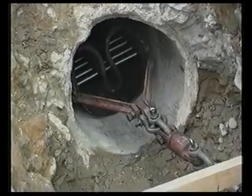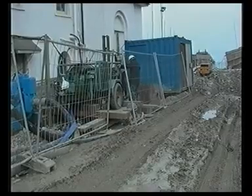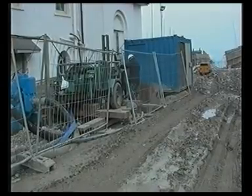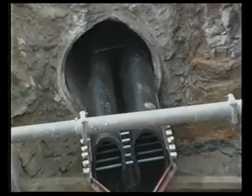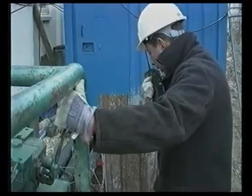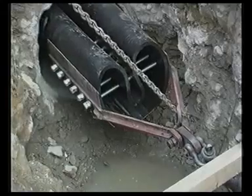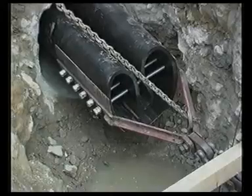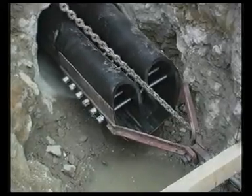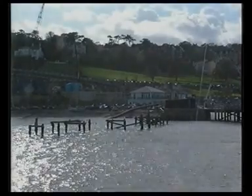The winch at the other end of the section to be renovated pulled through the 300 metres of pipe at a maximum pull weight of 8 tons — one fifth of the maximum permitted for this size and SDR of polyethylene pipe. The liner pipe was in place on schedule, a performance critical to the other extensive renovation and improvement activities being carried out by Wessex Water at Swanage.